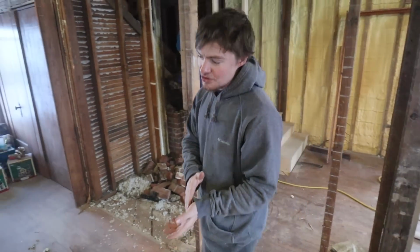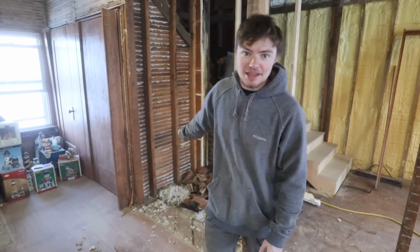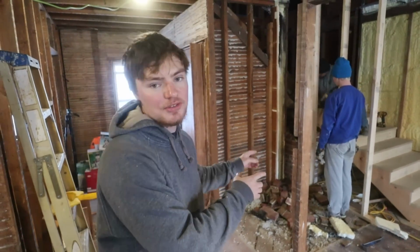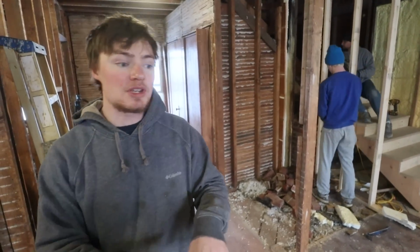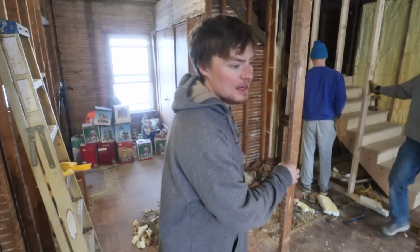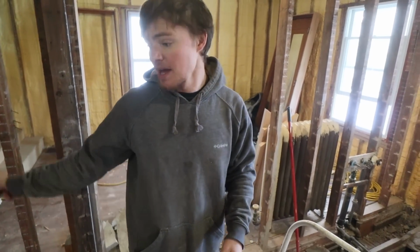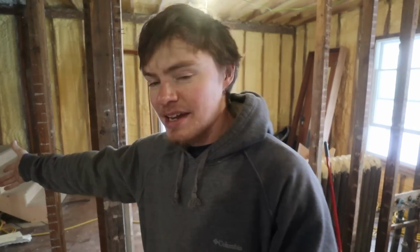And then while we were in the construction mode, we also decided there was a little closet here and we poured this out. We are going to have a utility closet here, and this utility closet is going to work out really well because we're actually going to run our sub panel into it for electricity. So then when we want to wire up these rooms, we'll have all the electricity on this floor running to that sub panel. So it'll be nice, easy, just running it up, over, boom, we want to run it into this bathroom, we want to run it into the bedroom. That way we're not having to run through like 4 different walls and 125 feet away over to the main panel. Just makes it a lot easier that way. Then also, if we blow a breaker, then we're not having to walk way down there, flipping it to come back. You just have it right here.